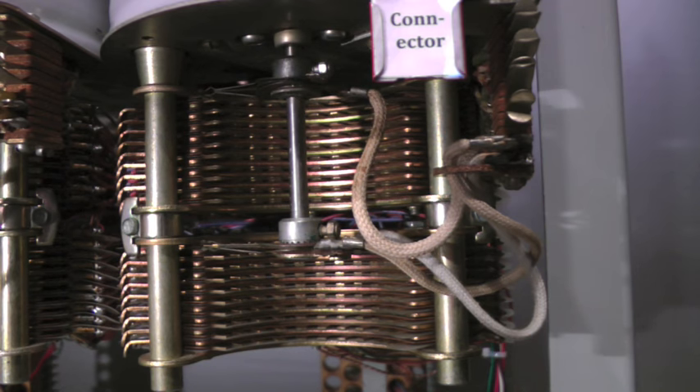At this point, instead of rotating to hunt for a trunk, the connector waits for the last — the unit's numeral — of the called telephone number to be pulsed. The connector follows the pulses, rotating the wipers across the terminals with the number of rotated steps equal to the number of pulses. The wipers stop on the terminal of the called telephone number.